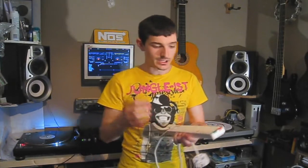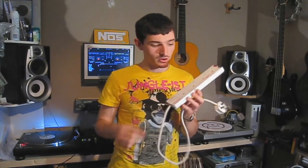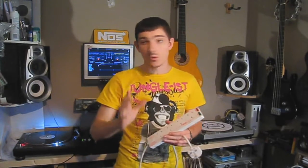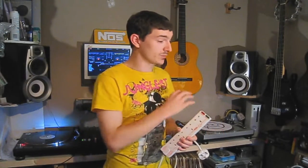These things can only take up to 13 amps anyway, and if you go over that, thankfully Edison invented that little device called a fuse, and that will just blow. You need to make sure what you're plugging in first, because if you've got a lamp, a mixer, another lamp, a deck, a TV — that's fine. However, if you've got three power amps, a really powerful PC, a plasma TV, and a kettle, you're going to be overloading pretty quickly. You don't want to be in the middle of a mix, turn your amp up, bang — the fuse blows, and you look a bit of a dick.